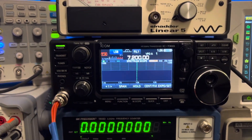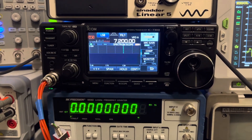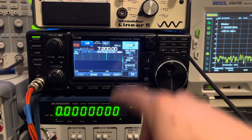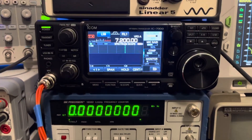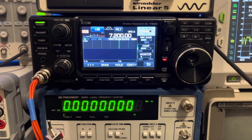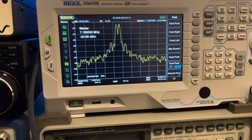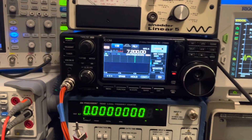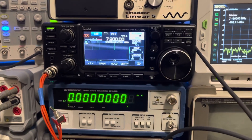I'm super impressed with Icom's ability to manage third order IMD even when you're wildly changing your power, mic gain, and speech compressor — it still maintains a very clean signal. We'll look at it one last time at 80 watts: mic gain at 50%, speech compressor at five. Very beautiful waveform, very clean — but just not at that Part 97 standard. Still very clean overall.